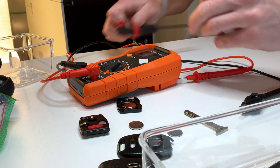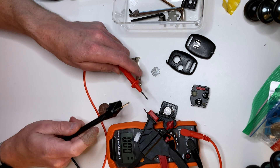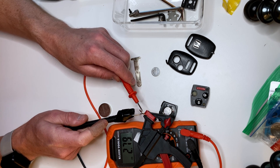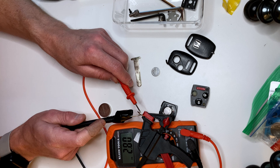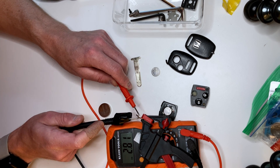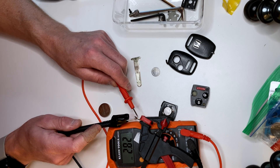Let's try one more. On a multimeter you're going to want to set it to the battery setting — make sure it's set on the 9 volt setting. This one is a little lower, reading 2.79. This is probably one that you might want to look at replacing. When they get below 2.9 the voltage is getting pretty low.